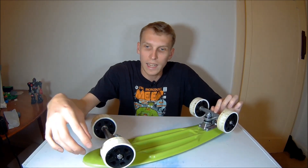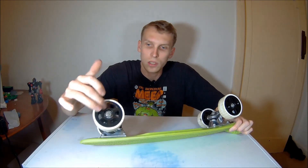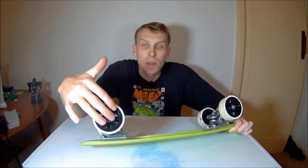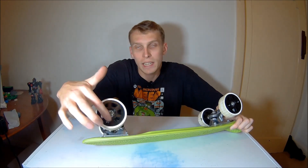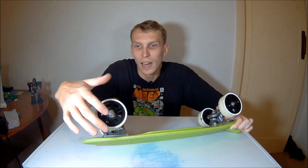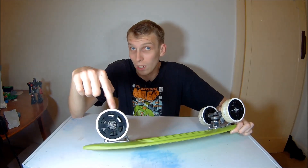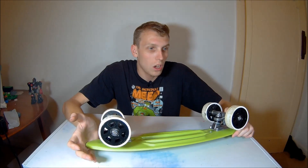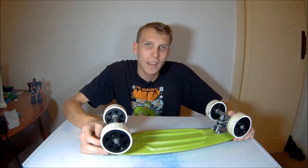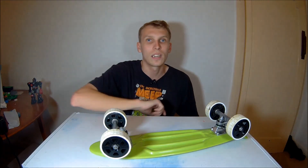Typically the top layer just peels away very quickly and then the wheels are pretty much dead after that because they're just going to keep breaking. But these with the TPU outer — the TPU outer is really doing its job well, it's holding up quite nicely. The only problem is, as you saw in the little clips, the wheels at the front kept binding up, which was a bit of an issue. I think it's because these bearings are a little bit loose in the actual wheel itself, so if those were printed a little bit tighter it would be better. However, I'm not going to do that because it's going to be very difficult to get this TPU wheel off again, so it's stuck with these hubs as they are for the moment. On the whole, pretty happy with how that went. Those wheels worked and worked very well — a lot better than any other skateboard wheels I've ever tried to 3D print in the past. So I hope you guys have enjoyed that one and I will see you in the next video.